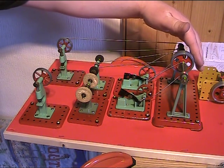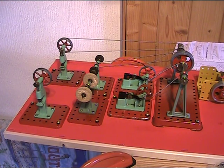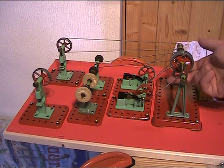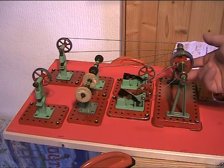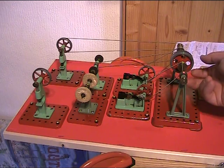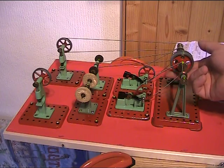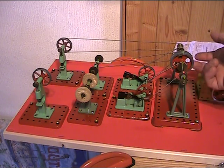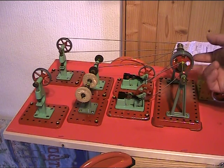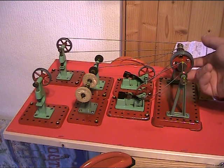but it's not all secure yet exactly, but as you can see, if I come round the other side and turn the flywheel on the line shaft, I think one of the belts needs shortening a little bit more really, looking at it on this one here. I don't know, it just seems a little slack, but it seems to be working, so unless it slips I shall leave it. But as you can see, that's 4 out of the 6 running, and there's very little in the way of load on that drive shaft.